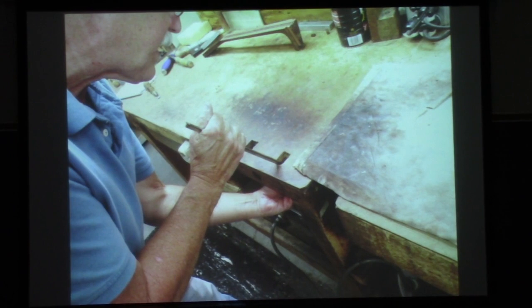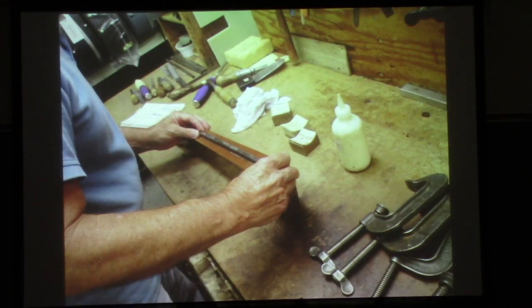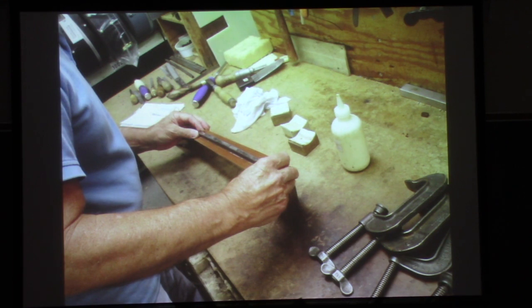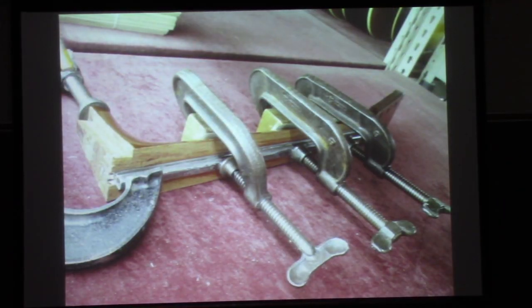This is Milt Hess. He was the structural repair guy for decades, and I learned a lot from him. He was really cool. So what he's doing here is he's got that T-bar in there, and he's putting a bend on it. He's just kind of loose. Now he's gluing it in, and he's got one of the more recent modern square tubes on top as a caul. They use a lot of yellow glue there, or white glue. It's hide glue occasionally, but pretty much everything in the repair department goes out with some type of vinyl glue or aliphatic resin.